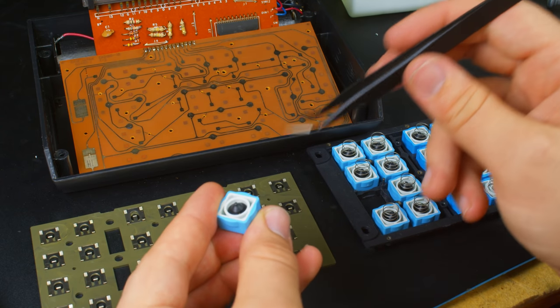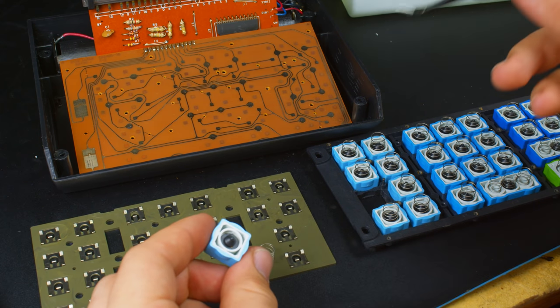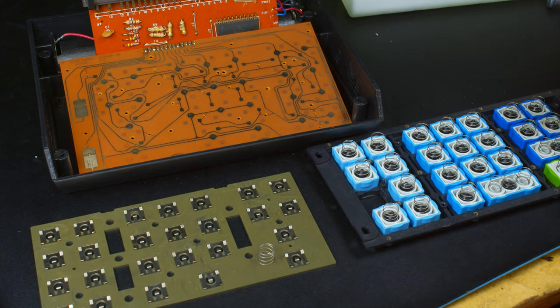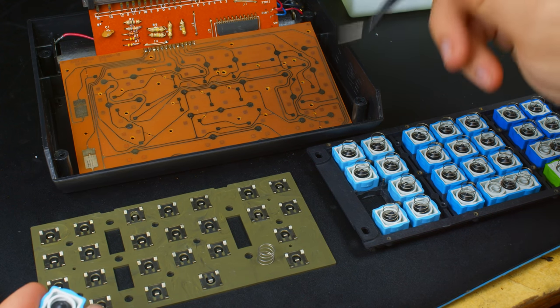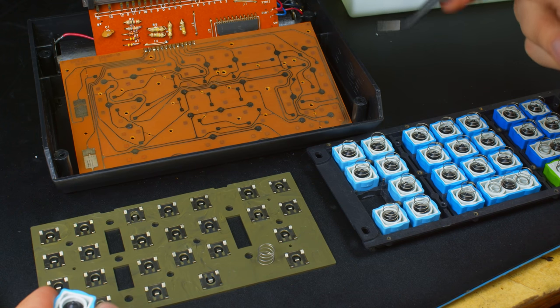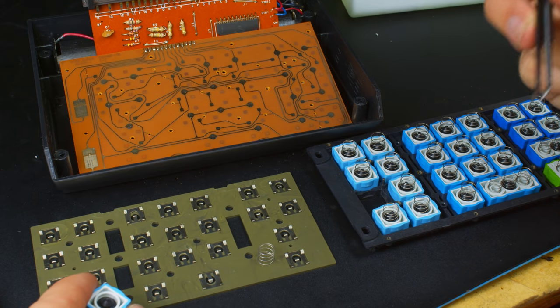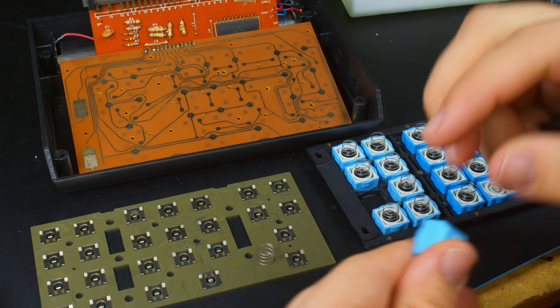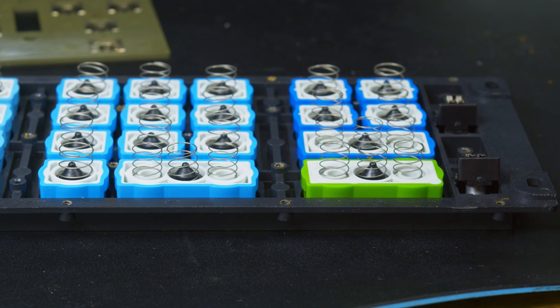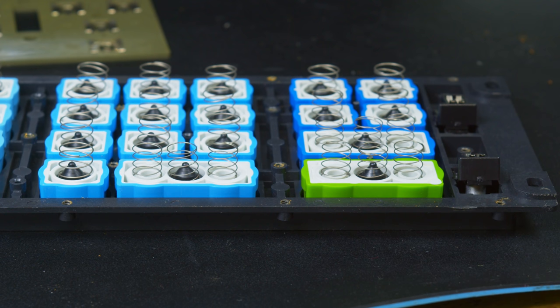So, wow, yeah. Totally different than anything else I've ever seen. And in no way better than any of the other ones. I'm really shocked why they did this. The Unisonic calculator I showed from 1972 had a weird dual spring system that made contact, and I can't see how this is better or cheaper to produce than that. I also like how their method for maintaining vertical alignment for the taller keys is to just add more springs in there. No, we don't need alignment shafts, just stick some more springs in there. It'll all even out eventually.